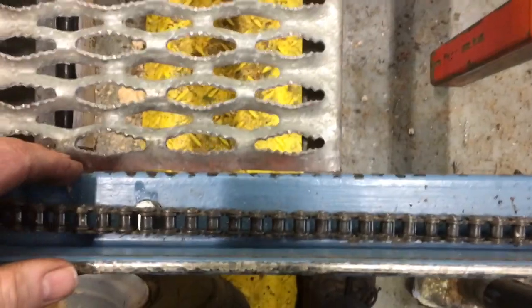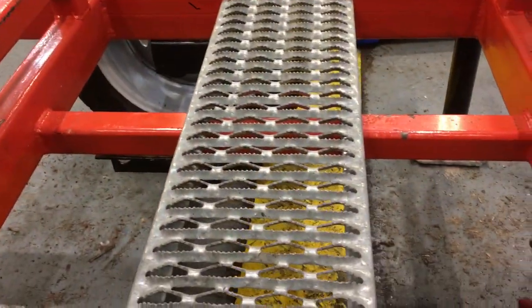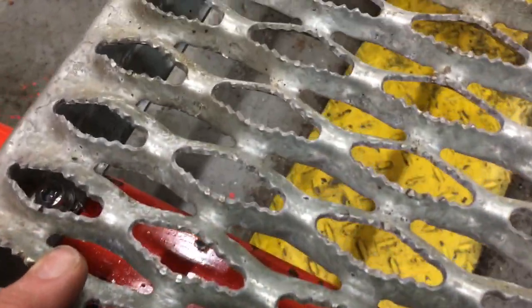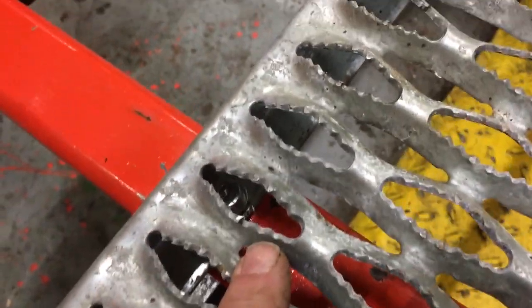I cut this to fit in between the rails — between this rail and that rail. I think it was 43 and 3 quarter inches to fit inside those 2 inch box steel. Then I drilled and tapped. You can see an Allen head bolt in there. I drilled and tapped 8mm so I could stand on this — that's one reason — for good traction, and to service the motor.